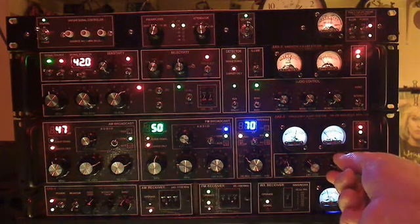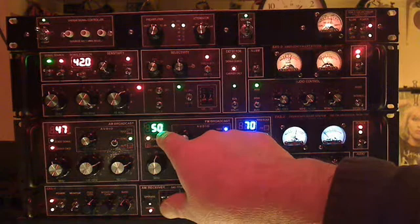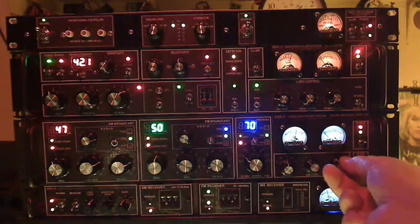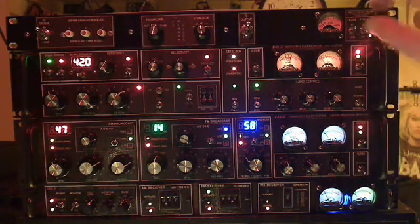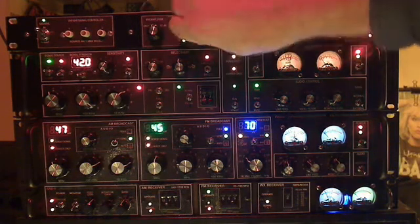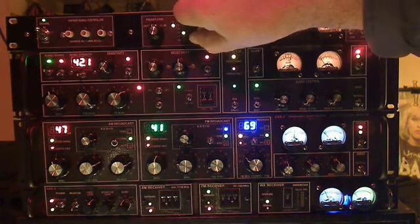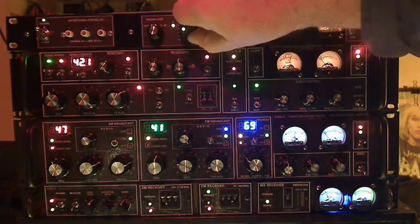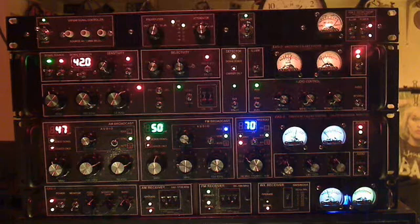Here's some of the recovered audio from this signal. We're at about S9, 50 microvolts. And in bypass mode — we lost it completely. Nothing but hash at 37. Just starting to come back around 39, 41. There's minus 10 dB at 48. There it is wide open — perfectly armchair copy. No hiss, no noise. FM from a fairly low-powered station.